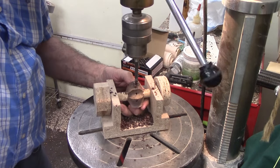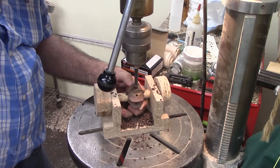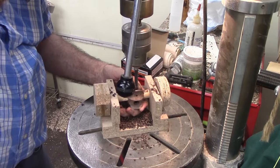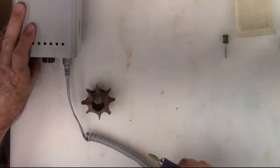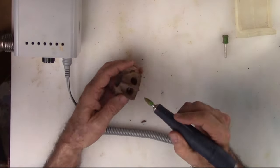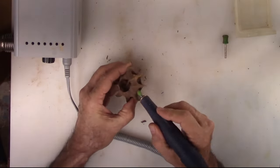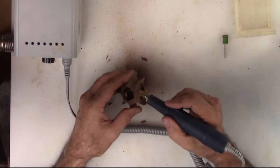At this point, if this were green wood, I would allow it to dry thoroughly — now being very thin, it should only take a week or two. Using a high-speed rotary tool and rotary rasp, I start carving. Each hole is enlarged to an oval and the wood at center removed. Any fin that still had a flat or other defect can be lightly touched and improved.